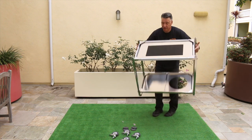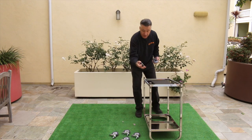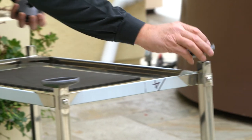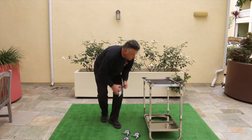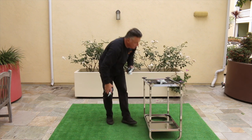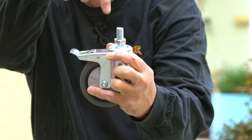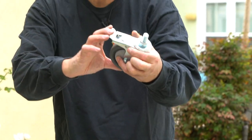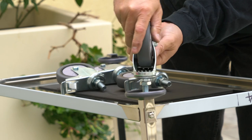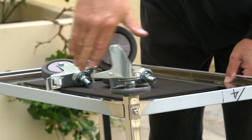Now I'm going to put the wheels on before I tighten everything down. What goes on next are these four bumpers — upside down — and I just make sure they're flush with the bottom of the leg. My little trick is I want to make sure all the nuts are all the way seated down on the bottom of this half-inch bolt, and then a washer goes here. I put the brake on, then I simply thread it in and I can turn this whole wheel with the brake on, seated all the way down.